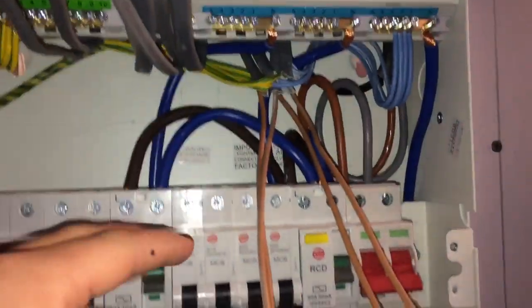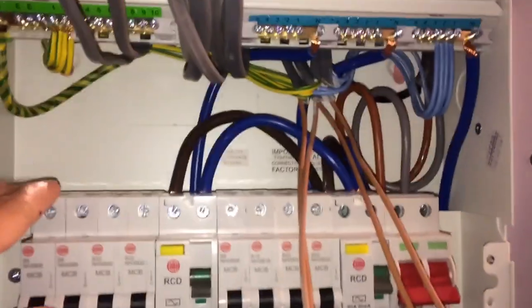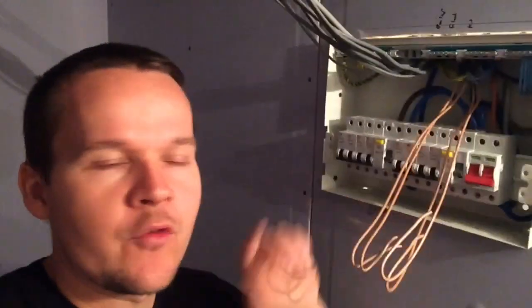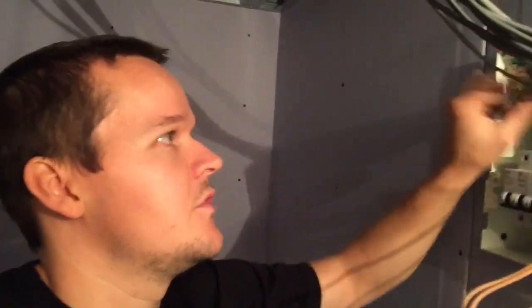Normally you bring all your cables in, split them off, and then what I do is leave my lives all down, get all the cables back in first and pushed out of the way, and then you can dress all the lives in. On a job like this when you're making a fuse board off, you've normally second-fixed all the sockets and lighting points so you can do all your testing — end to ends, insulation resistance. But in this job they want us to finish the board and come back to do the second fixing. So rather than twisting any of the earths together, I've put them in separate sheathing so you can split them easily to test the end to ends and ring final circuits.